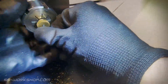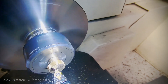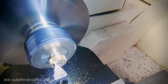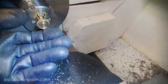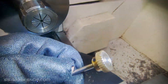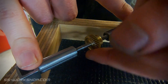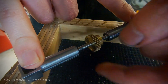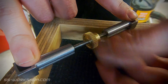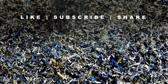The last task today is to turn a decorative face on a small purchased gear, matching a gear visible on the original locomotive. With the mechanism assembled you can see how it works — a left-hand screw on one side and a right-hand screw on the other means when the gear is turned the pistons extend and retract, while the keyway prevents rotation. In the next episode I'll make up the remaining parts so we can see how this works once fully assembled.